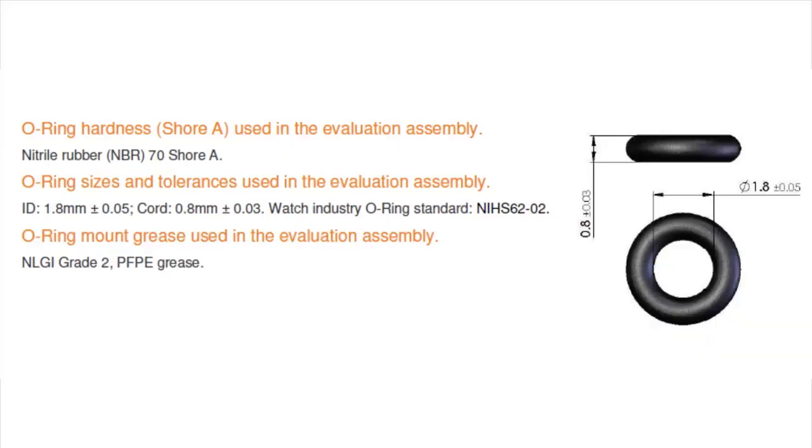You do need the O-ring — it doesn't come with it. The O-ring is what gives you the seal so that water or gas doesn't leak into the rest of your assembly. But thankfully they give you the exact specifications of the hardness and the diameter.